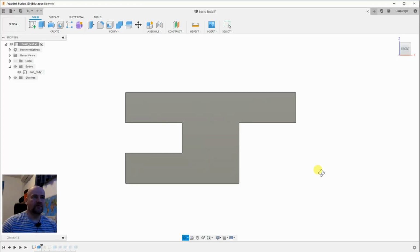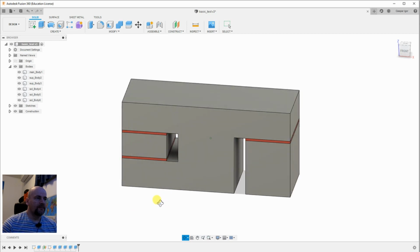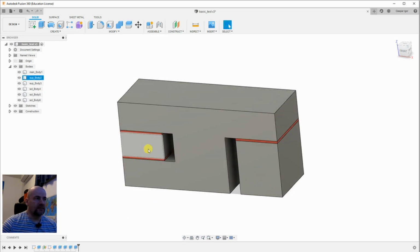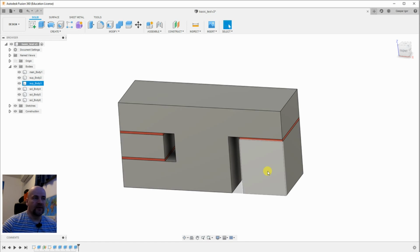Okay, this will be my first test object for these soluble filaments. So I created some custom supports, because I know that automatic supports would start from the printing bed, but this one would start from the object, and I know that automatic supports generated by the slicer would be very hard to separate from this object. So the custom supports will be from the same material as the object, only the contact layer will be in soluble filaments. I will use 0.2 millimeter layer height, so I created 0.4 millimeter for this contact block,